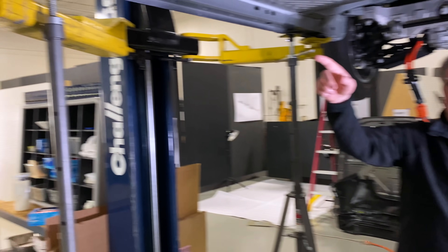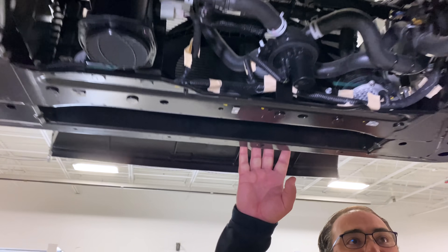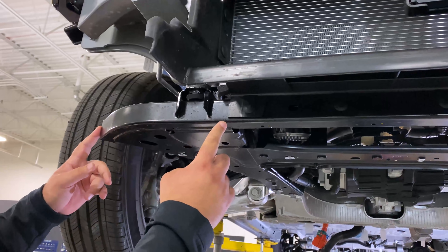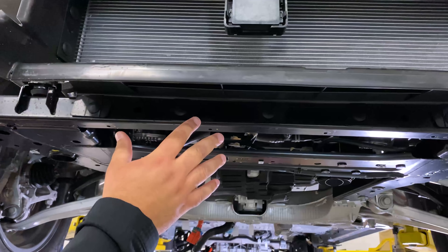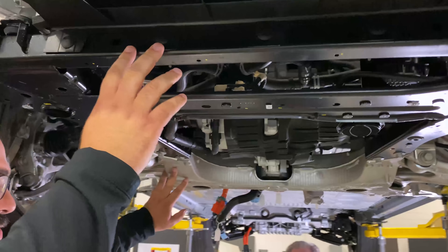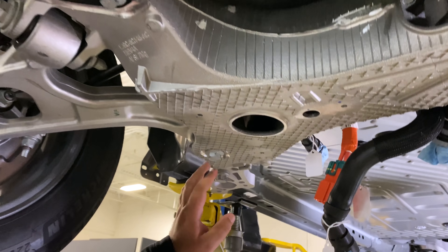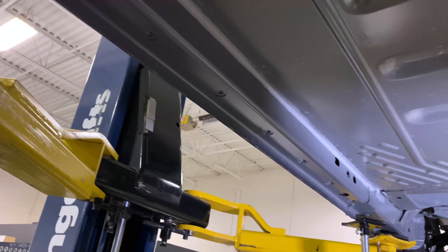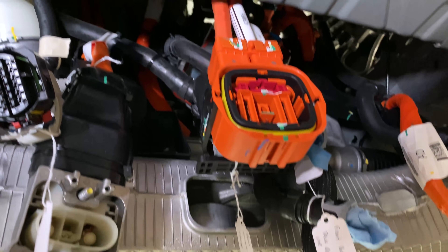So now it would make more sense about what's going on with this. If we walk towards the front of the vehicle, we had the cradle with tusks coming forward that we talked about in an earlier video. A tusk is when it comes out to the side to help with the small overlap rigid barrier test. This part of the cradle, when you have a frontal impact, will transfer forces back and into the hollow cast aluminum portion of the cradle, and then these keep transferring the forces back and out to the rails of the battery tray.